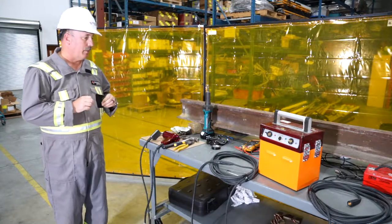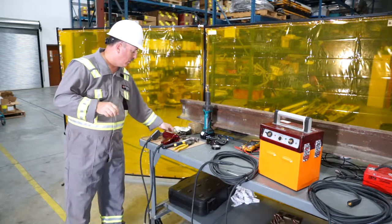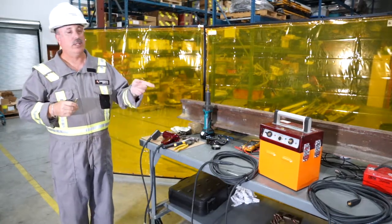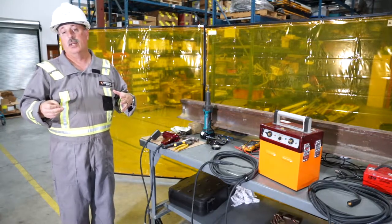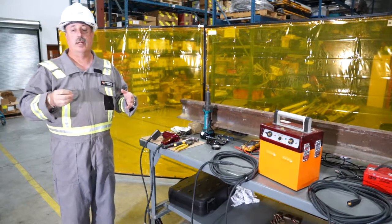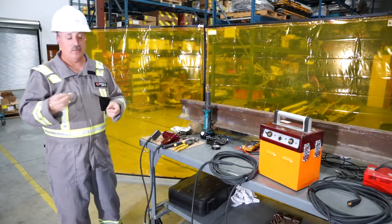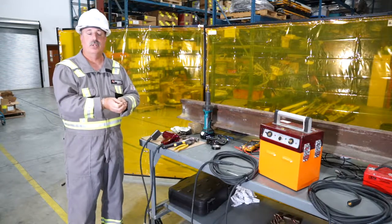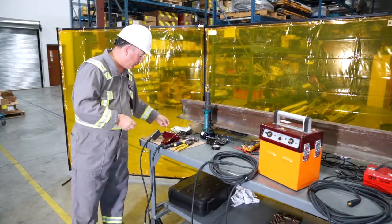The first thing I want to talk about is what the process is. We're utilizing a 36-volt or three 12-volt battery system that generates 38 to 40 volts, which creates 240 amps and heats the pin to 650 degrees to attach a rail bond to a piece of rail.